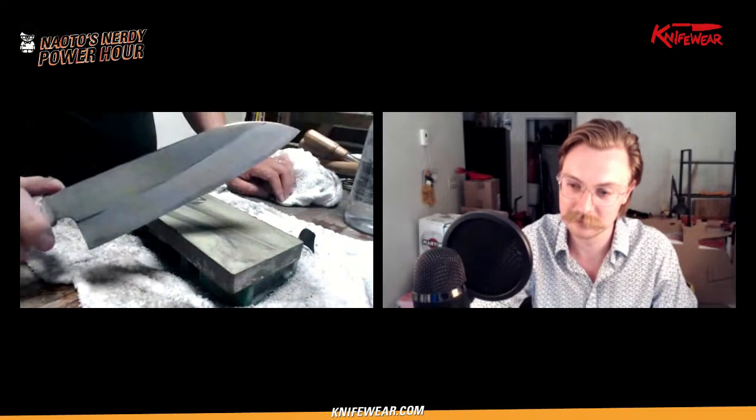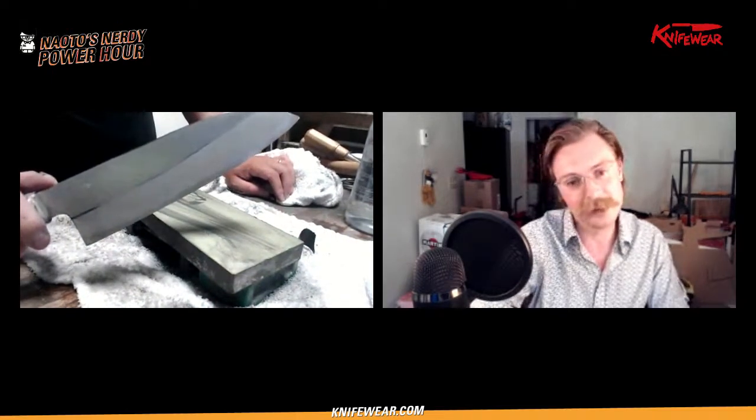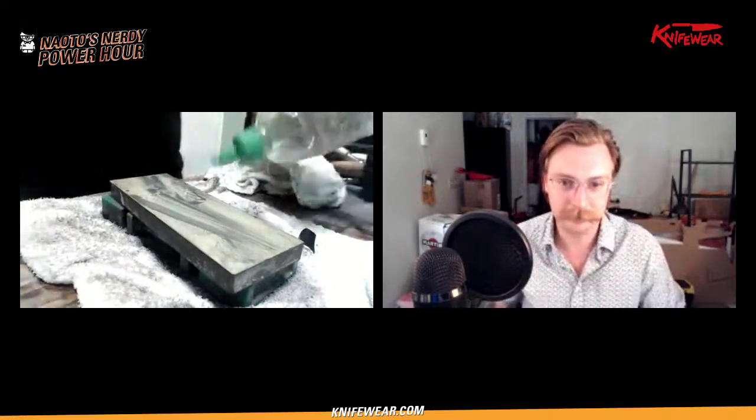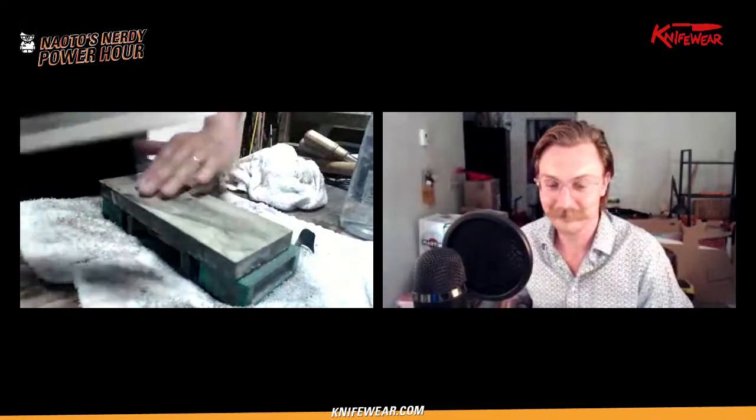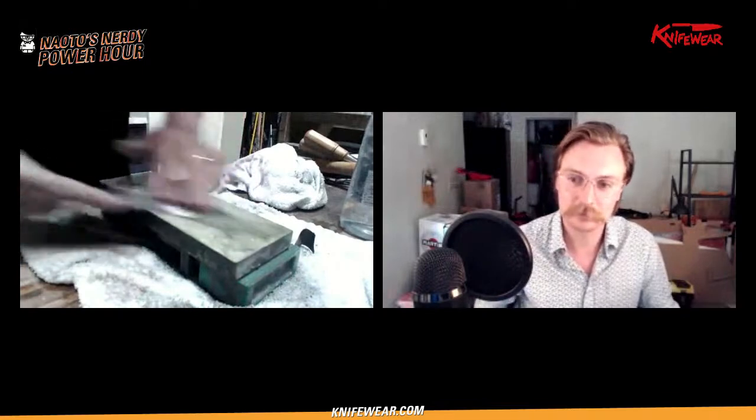Sorry, the glare. It's a 1,000 grit stone right now. So I'm going to make it as many of you like, a nice kasumi to finish. It just looks so nice, right? But yeah, this class I wanted people to know that it's not only working on the bevel, but working on this part is also important to get this flat. That's the lesson that you want to take, I guess, from today's class.